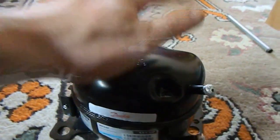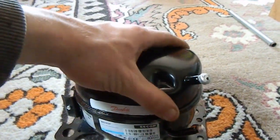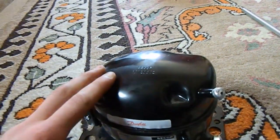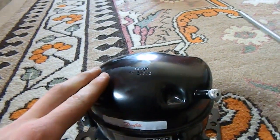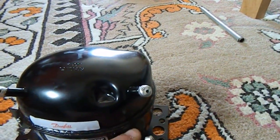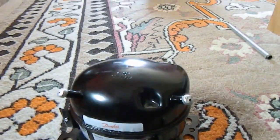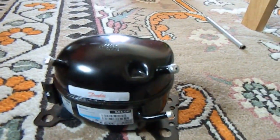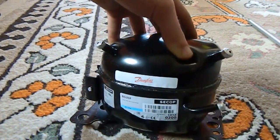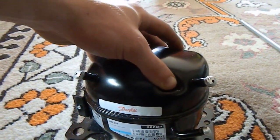I will not be turning this on until it's actually been assembled into a system. The main reason being I just don't want to get any contaminants in, or at least as few as possible. I also will not be brazing the fittings because unfortunately I cannot find brazing rods for refrigeration anywhere on eBay — if I do find them they either have to be imported from America or they are extremely expensive, like over £100 for a pack.